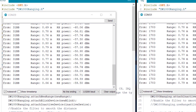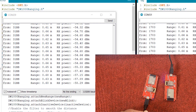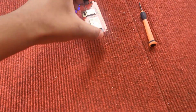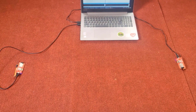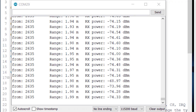As you can see, when one of the boards is moved, there is variation in the distance. Now we need to check whether the measured distance is correct. I have placed two marks at a distance of 1 meter apart. The measured distance between these two marks should be exactly 1 meter. However, in the serial monitor, the measured distance is almost 2 meters, which is absolutely incorrect — it should have shown 1 meter. The reason is due to antenna delay.